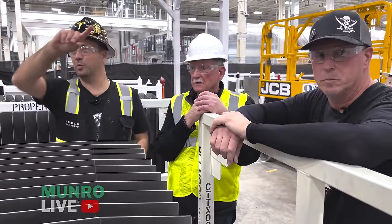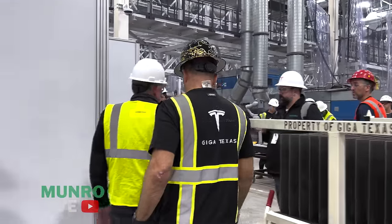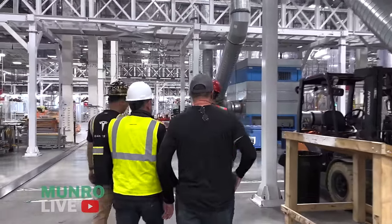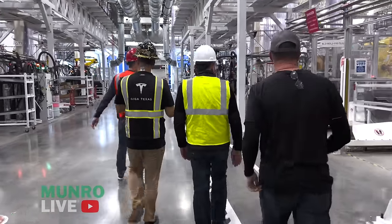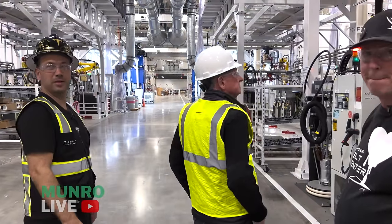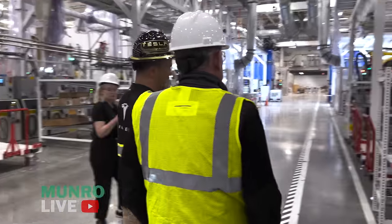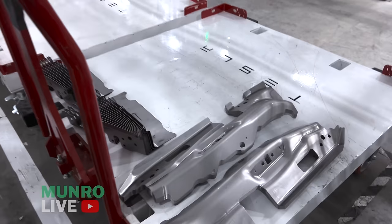After the panel goes over conveyance it goes into the weld cell, then we finish it and we're done. We have the inner from downstairs and the outer, and we need to put them together without making any marks. We load the inners in here — this cell takes the inner panel and a hinge reinforcement and spot welds them together. Just a couple of spot welds. Pretty traditional on that part. But we don't have any reinforcements on the exterior panels.